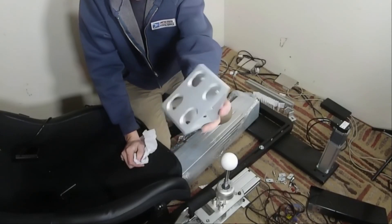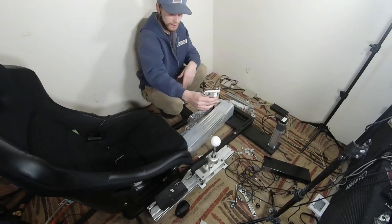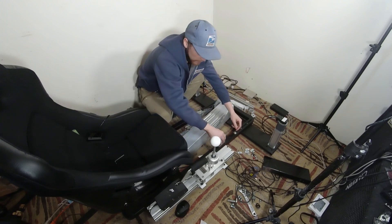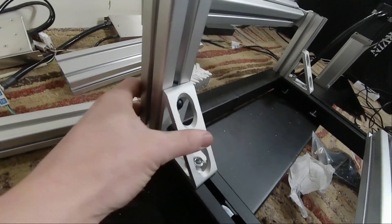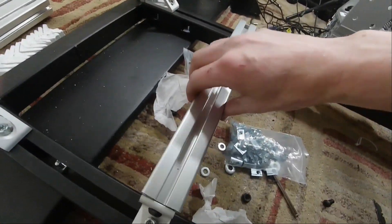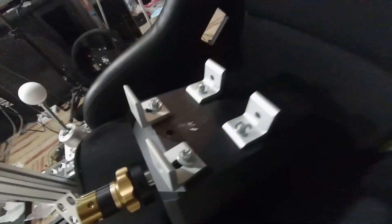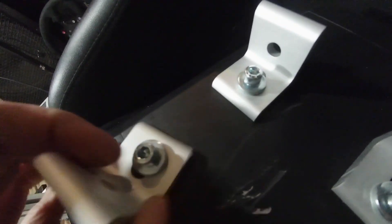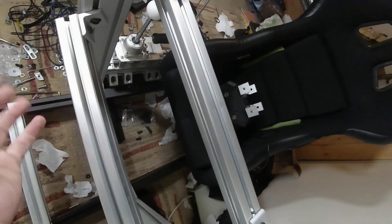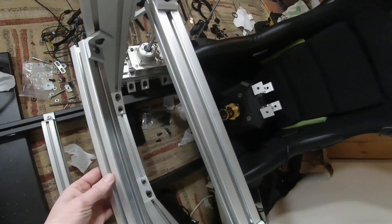That's a serious bracket right there. So this is what we're going to be using to attach the wheelbase to the actual steel here. This can slide back and forth, this right here can slide up and down, and both of these can tilt whatever way they need to. These are all on sliders as well, so they all have a lot of room for adjustment, and they have a little bit of side-to-side play too since it's 8mm and these are 6mm screws.